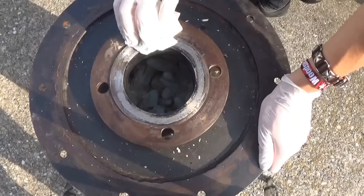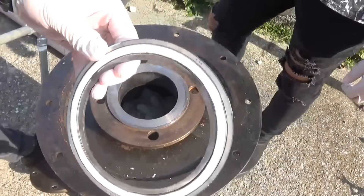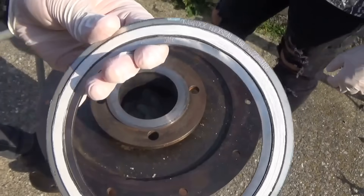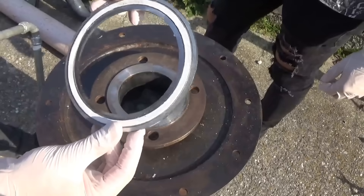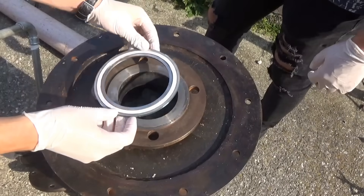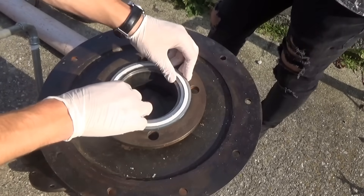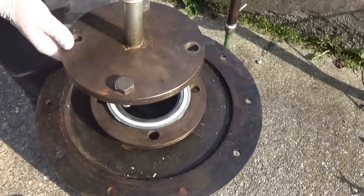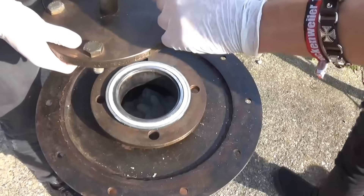When the reactor is filled we have to clean the flange so the sealing is tight. I am using Garlock metal seals for this run, which were kindly sponsored by them. They are the high class of sealings and can stand 700 degrees Celsius with ease. They are also resistant to almost all acids, bases, and hydrocarbons you encounter, making them perfect for this application. The Garlock seals are made out of a hard metal ring filled with softer metal rings and some kind of chemical-resistant filler in between the soft metal rings.